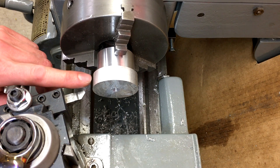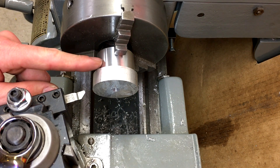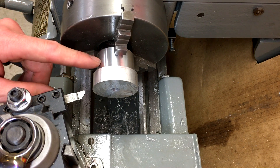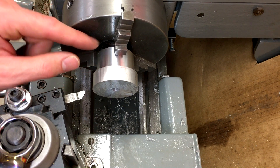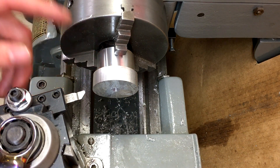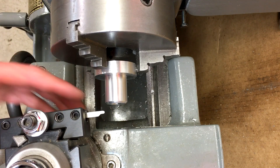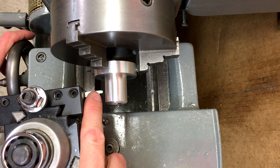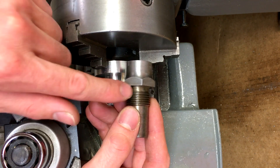We're taking it down to 7/8 which is what the threads are going into the saddle of the lathe. I don't really have any specification over how wide to leave this shoulder — it'll probably be somewhere between 3/8 and 1/2 inch because it'll get a countersunk hole for socket head cap screws that are going to thread into here. So let me take that down off camera and then we'll come back for the threading part. The last thing I'm going to do before I start threading is put a small thread relief in here — I just have a piece of high speed steel ground with a little radius on it — and we're just going to replicate something like this so we have an area to run out and stop our thread in.